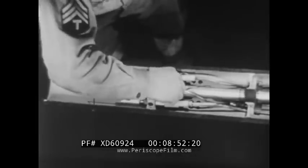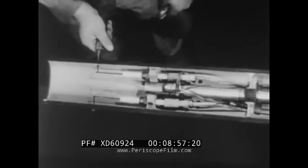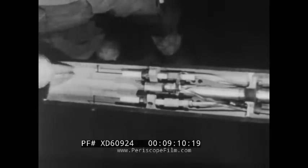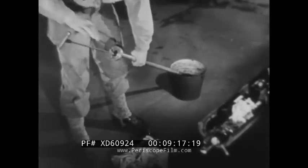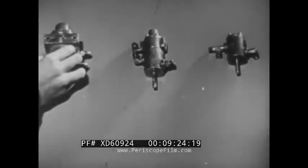See that the nozzle is aligned behind the hole in the plate, and make sure everything is secure. If there's any fuel residue in the dummy tube, scrape it out — otherwise it'll ignite and cause muzzle burning. Dried residual fuel can clog up the long extension nozzle, so be sure to keep the bore clean. After firing 15 loads of fuel, give the entire unit a more thorough going over.